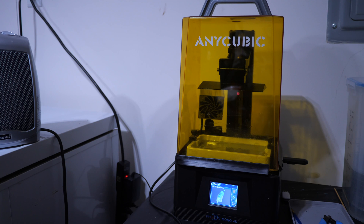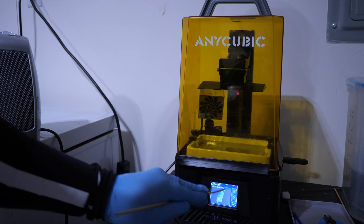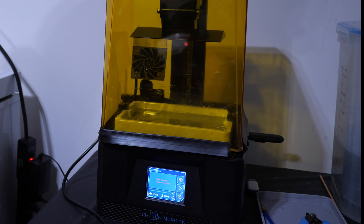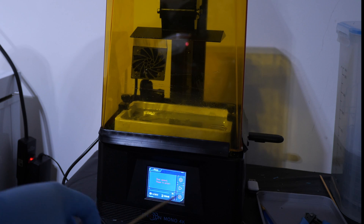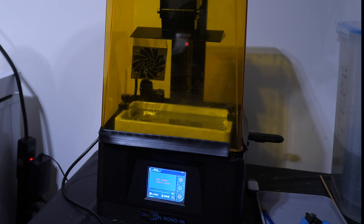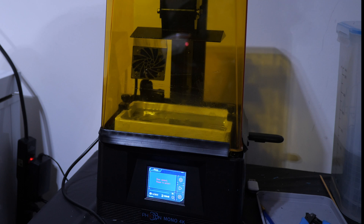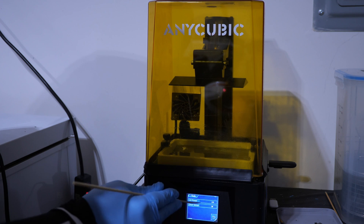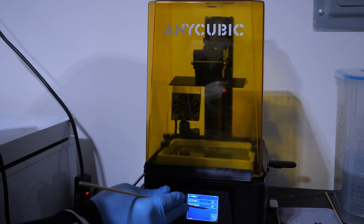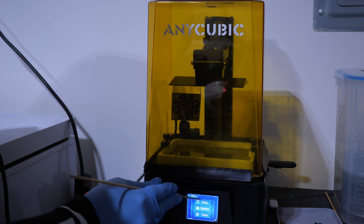Now that all the heat is inside, we've got this rubber seal all the way around, which should do a good job of keeping that heat in. Now I'm going to start my print. Because we have that rubber seal on, the printer is not going to operate — this one has a safety feature that won't let it start unless the lid is securely on. I'll try to jostle it a little to see if I can trip the sensor, but if that doesn't work, I'll go into the settings and disable that safety feature. Lots of people do this, especially for time lapses. So we'll go to Tools, click the four squares, go to Door Sensor, and just turn it off. Now we can go back and start the print as normal.